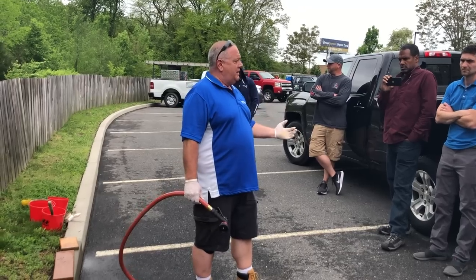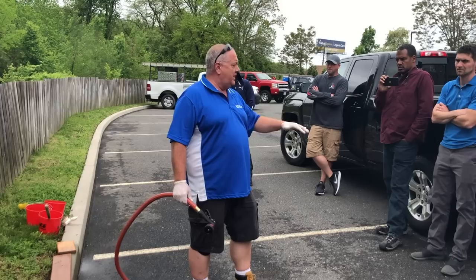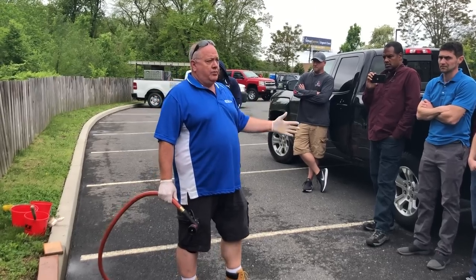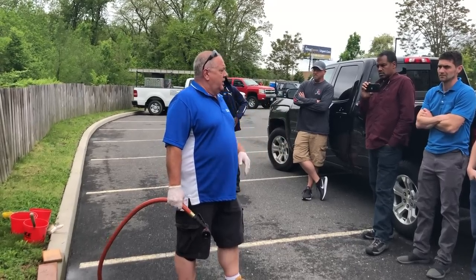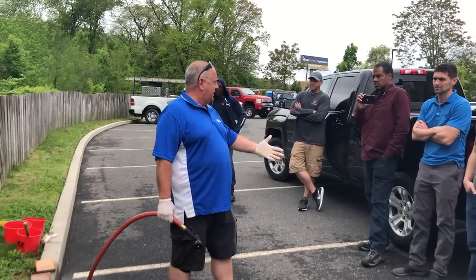If they wear away, that makes it easier for us going back to sell the maintenance, because now all we have to do is a light clean, replenish, and recoat. With the acrylics or other film formers, once they're off, you have to reinvent the wheel every time. Every time you go back, you're going to be stripping and restaining again. That's why the maintenance ones are a lot better for a contractor, because it also keeps us coming back.